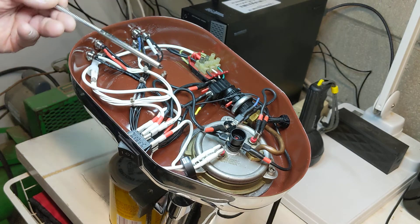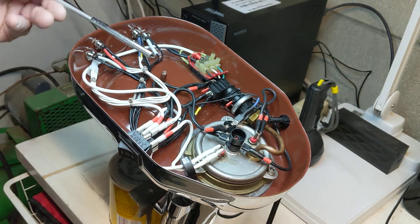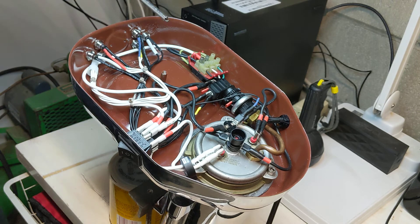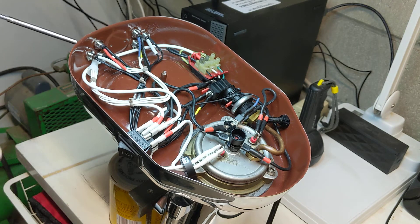It gets a little more complicated here because there are a lot of wires — I probably didn't need to do this but I did it because I could and it's a lot of fun. It lets me see what's going on inside my machine. I added six indicator lights on the front panel. They're fairly easy to do — I had to use a resistor on each one because I'm running 110 volts. Five of them have resistors; I'll explain the sixth in a minute.